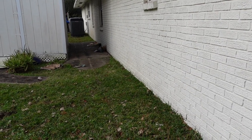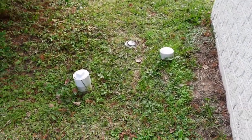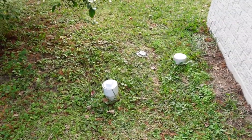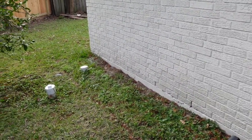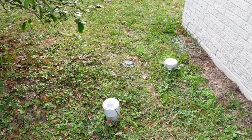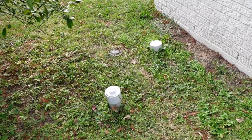The property has a little bit of grading and high soil. The client informed us they're going to do a hydrostatic test, which is nice. Out here you can see they've done some sort of repair — it looks like they replaced the cast iron at one point. We'll determine if it goes underneath the structure when the plumber arrives. We'll put in the report: it looks like there's been prior repair — recommend contacting the seller and asking for any warranty that might be involved with this plumbing repair.